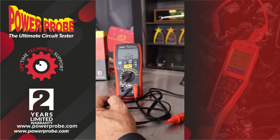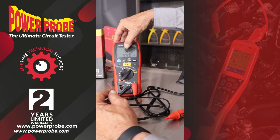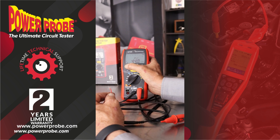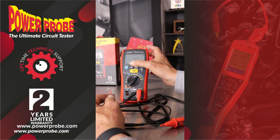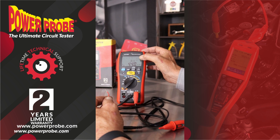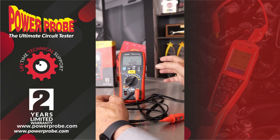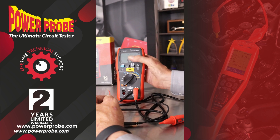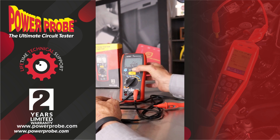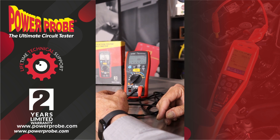Test is done. This is my result — it's measuring in this case 44 gigaohms. This number here was the applied voltage during the test, 251 volts. If you hit the setup button it cycles between these — this is the actual amount of leakage current that occurred during the test; in this case it's 0.11 nanoamps, almost zero leakage. And there is a compare function so you can set a preset value — right now it's only set at 100 megaohms.